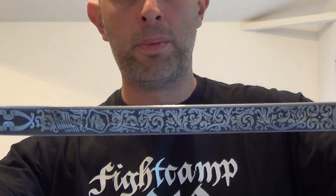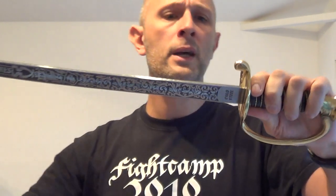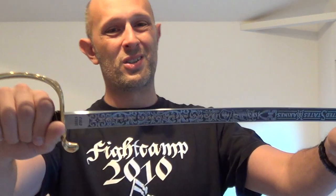The etching itself is pretty good. It's what we describe as frost etching — the acid hasn't been allowed to burn very deeply into the blade and they've gone for a black and white pattern, which is historically quite correct. It's not my favourite kind of etching though. I prefer etching which has some profile that actually bites into the blade, which is also the most durable type. Frost etching is notorious for rubbing off in use, and if you need to polish the sword it's very difficult to do without destroying the etching. That said, the blade appears to have good flex and, as I said, good distal taper.